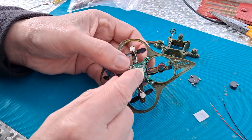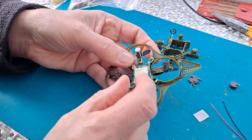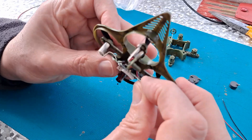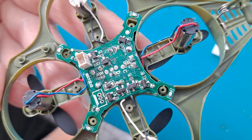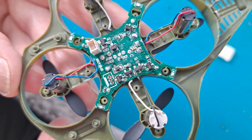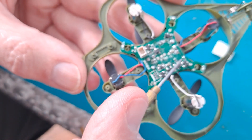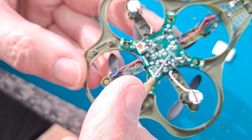I'm going to make it really simple — we can just have it sticking right out the top here somewhere, we only need a tiny little bit sticking out. That would save us getting the battery out each time. So I'm going to solder on those two tags, but we need to know which way round is positive and negative. I'll do a little close-up of that circuit board in a minute just so we can see the detail on it. I've taken a bit of foam off so we can see the circuit board, and it's not labelled positive and negative, so I'm going to have to put the battery back on and just put a meter across there to check which way round it is.